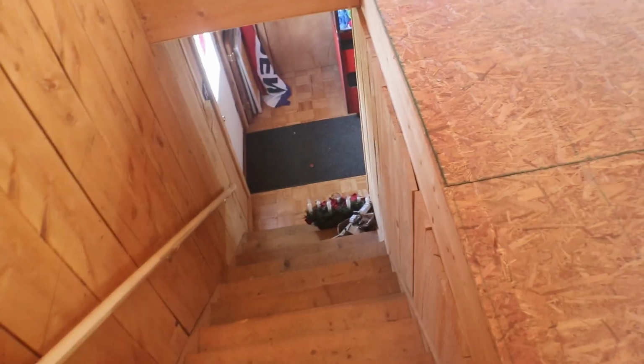The one problem I do see is whoever built this must have been drunk. This is the outside wall. It's out of plumb. Oh God, probably that's about an inch and a quarter, and that's only over 4 foot. So it's going to be about 2.5 inches off up to the top. So we'll have to do a little creative shimming over there to get that little wall plumb.